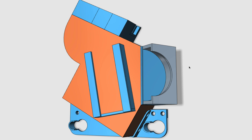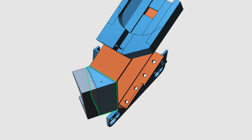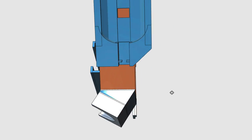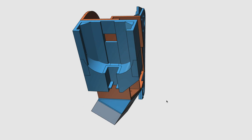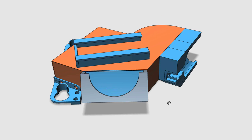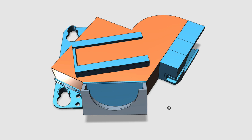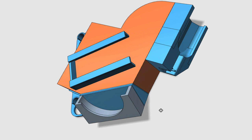That was an interesting discovery: the exact measurement you take with calipers doesn't necessarily translate into a perfect fit. You have to try it and test it — which is exactly like software. So I designed this angle piece so that when it stays level, the fan holder slots in and doesn't drop out. The first time I designed it I designed it backwards so the fan holder was pointing down. It took me a little while to realize that, so I went and redid it and printed it right.